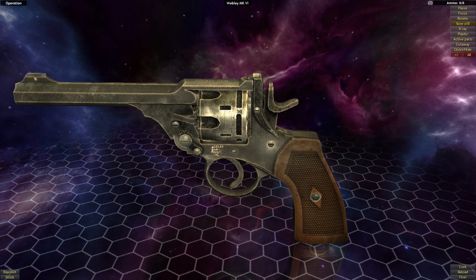The reason is because of the main limitation of a top break revolver, its ability to handle higher pressure ammunition. Unlike a solid frame revolver like the Smith & Wesson example we looked at earlier, where the pressure can be spread throughout the frame, a top break revolver focuses most of the pressure at a single point, the latch. This is an issue that most break-action firearms have, and the strain over time on some break-action designs can eventually stretch the latch to the point of needing repair or replacement before the firearm will operate properly.